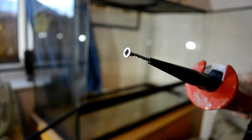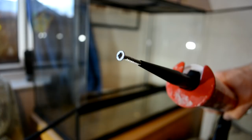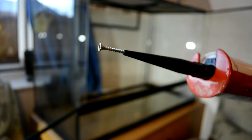When cleaning the silicone I mainly paid attention to the side that had the pond in. Here's a quick tip: to stop your silicone drying out or going hard, you can just shove a screw in the end. You kind of just screw it in there and that stops air getting in and going hard — and even if the bit does go hard when you unscrew it, it seems to unblock itself quite nicely.